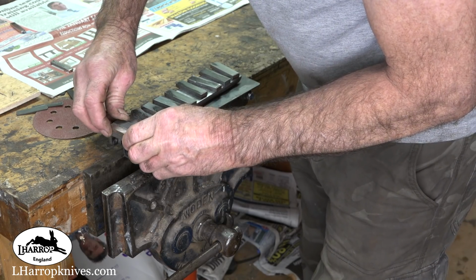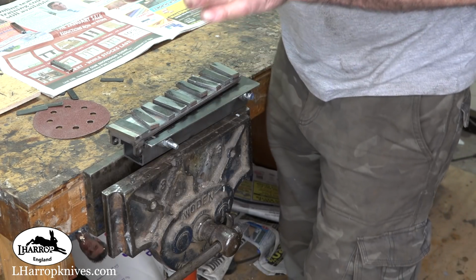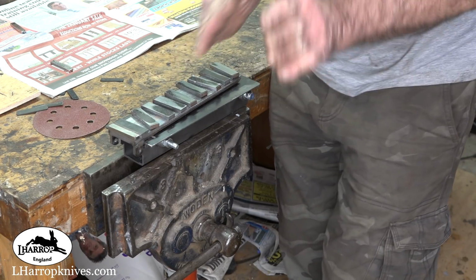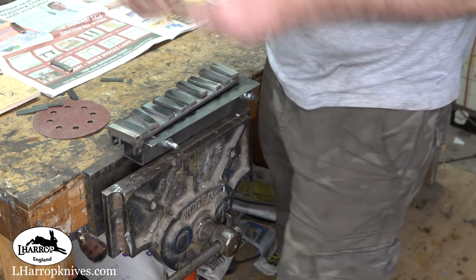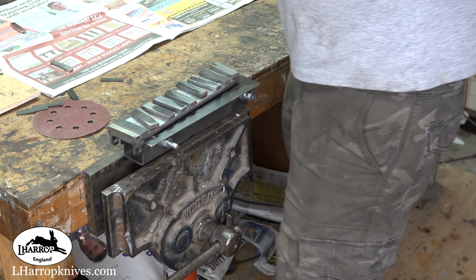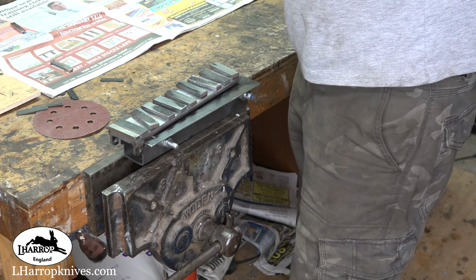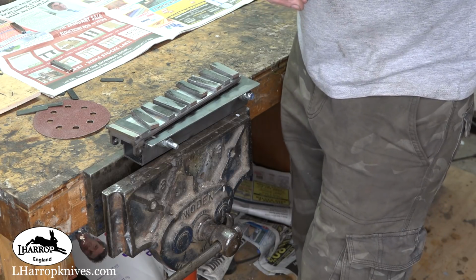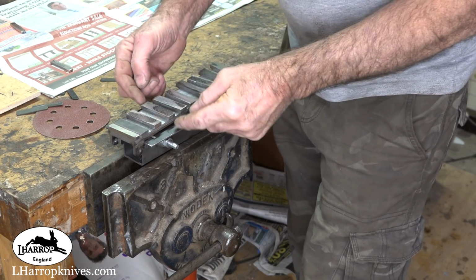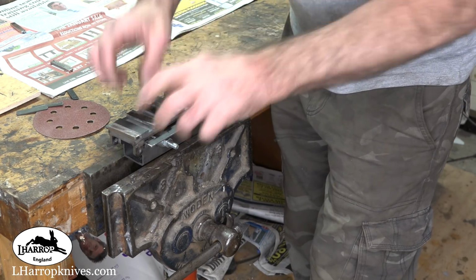I have hit them with the grinder underneath and on the sides, and I've kind of shaped them a bit like a pyramid, so the epoxy will grab and they won't lift. Hopefully the epoxy will stand the heat of the grinder, of the metal that's on it. So what I'm going to do is tack weld all these in place, and then I'm going to bang the magnets in,